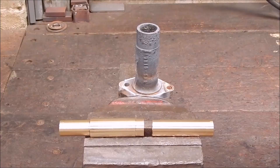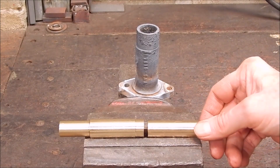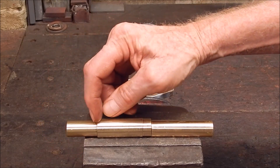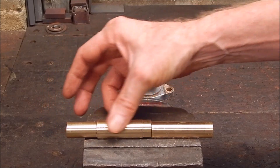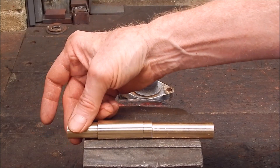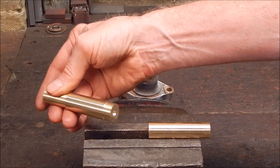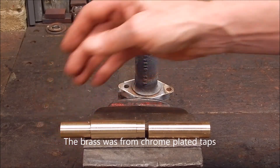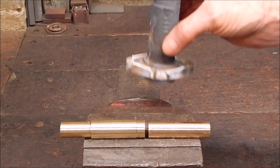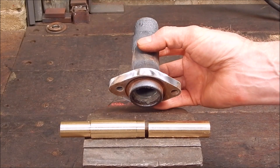Not bad — so here's the first cast with the blemish there, not bad, it's usable. And here's the second one — I bumped up the temperature, there's an imperfection there, and I've machined out any outside imperfections. I've got a nice usable piece of brass there. That's come up pretty damn good. It's successful, definitely saves some money. The higher temperature did help, getting the mold hotter did help, and it came out of the cast iron mold no problem at all.